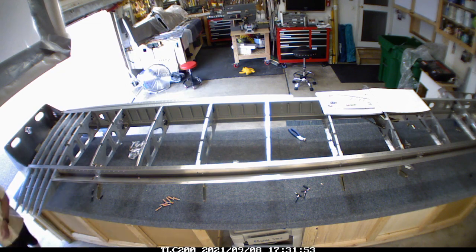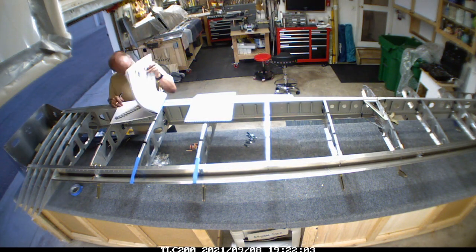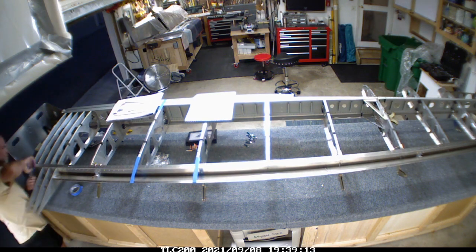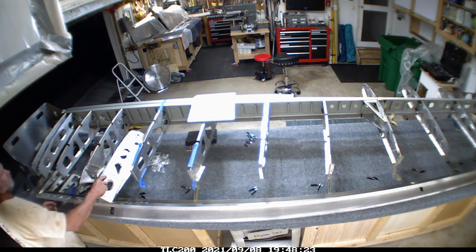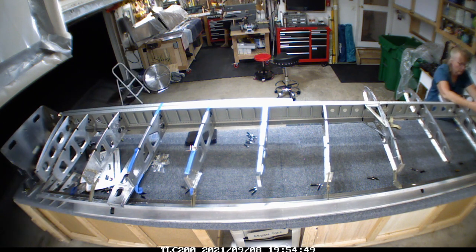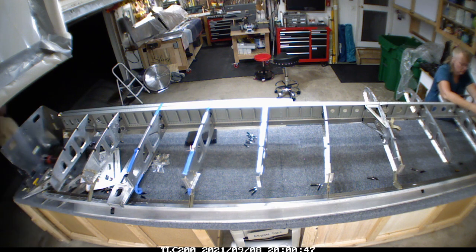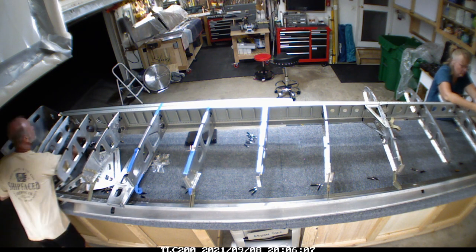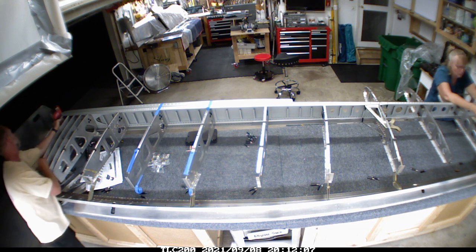There are some bolts that need to be torqued. You'll see me taping off some ribs because I don't have one of the internal bars for the wing — it's back-ordered and there's no shipping information yet, so it may be a while. I want to keep going as far as I can without blocking myself in. Those two taped ribs I'll need to be able to move to get that bar into place. There's also that leading edge rib on the right-hand side — I think I need one more, but I'm not sure, and that's where the fuel tank leading edge skin is going to come into play.